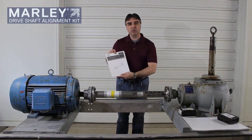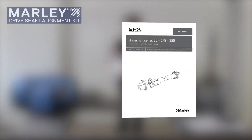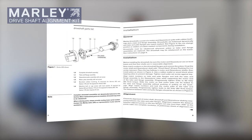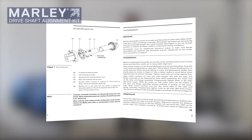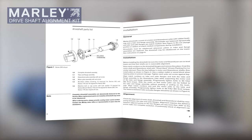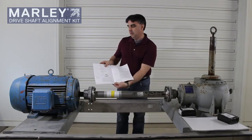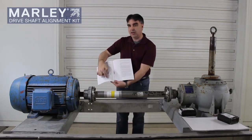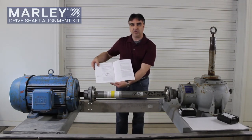When it's time to check your driveshaft alignment, it's always good to get your driveshaft user manual. This is the user manual for the 6Q, 175, and 250. Inside, you'll see the assembly breakdown. This is a precision alignment — each end has to be within five thousandths of an inch, so that is why we have to use our dial indicator kit to check that alignment. You have step-by-step instructions in your user manual on how to use that kit and do the final checks.